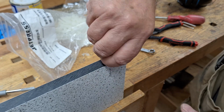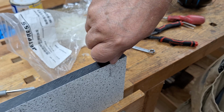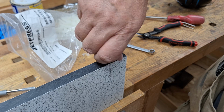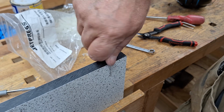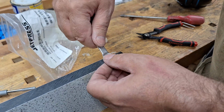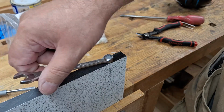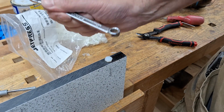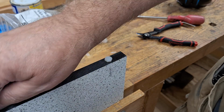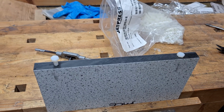If you are building this jig out of MDF, don't forget to insert a couple of dowels through the MDF so that you can tap into them rather than just MDF. For a bolt like this, which is going to be set just once, you can tap a hardwood dowel, such as cherry or maple, very successfully. Set it and forget it. And now I can use that and the same one at the other end over here to square it up on the table.